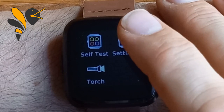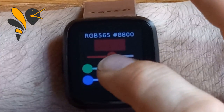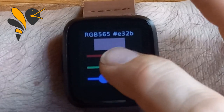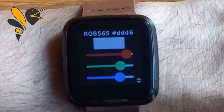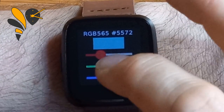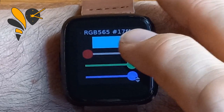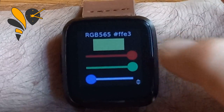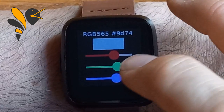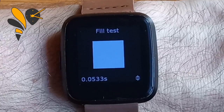Other things going on: in the self-test we've got sliders — this hasn't been shown on any videos before. These are three forced sliders which I can use to generate color patches. When I'm experimenting with themes it's actually really quite useful to get the color on screen, because the PineTime color response is just a tiny bit strange. The cyan isn't as cyan as you'd think it should be, and the yellow is not as powerfully yellow as it might be — the color response is not quite the same as you'd expect from a normal RGB device.